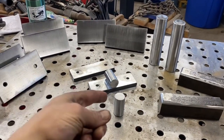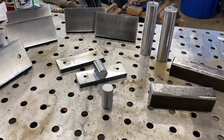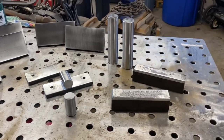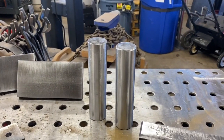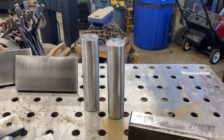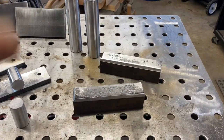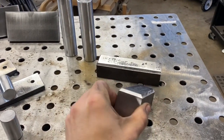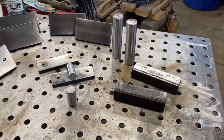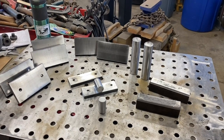The larger stock is ready for our drawing dies — that's probably going to require two or three weld passes all the way around for some proper penetration to complete the attachment. The flattening dies I went ahead and ground in some bevels, which is going to give us good penetration and make the die nice and solid. We're basically prepped and ready. I'm going to set this up in the machine to tack it up and do one at a time.